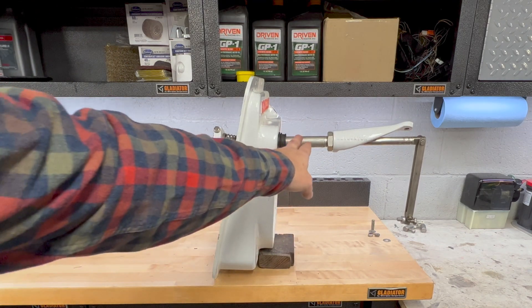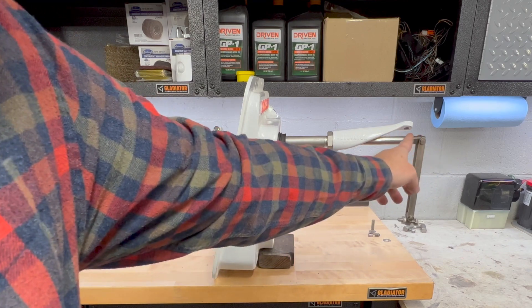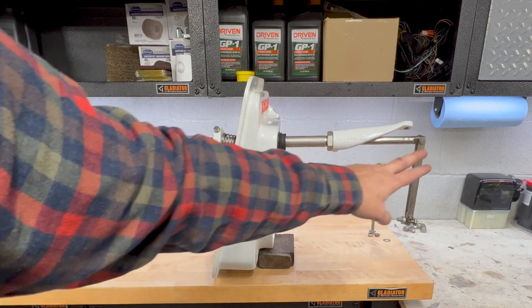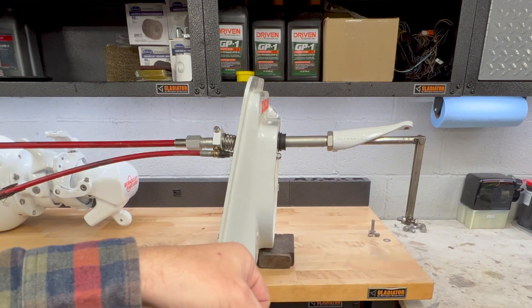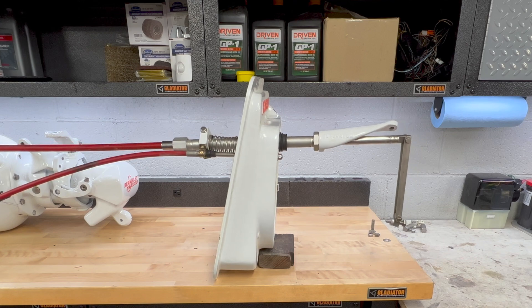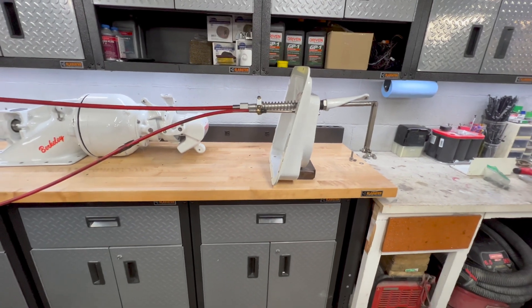You can see I just pushed this all the way out, which would be pushing the nozzle all the way into the down position. As you can see on the video, the steering didn't change at all in relation to where the jetovator is at. Now I'll pull this back — that brings it all the way to the up position. You'll notice the steering stays at the same length. I'm essentially sliding the entire steering cable outer sheath and inner sheath in and out of the transom.